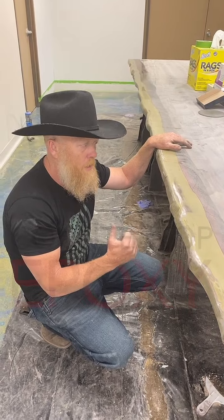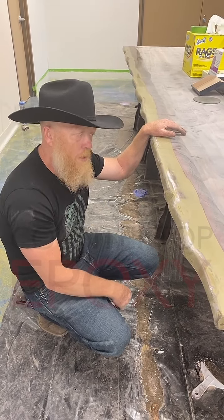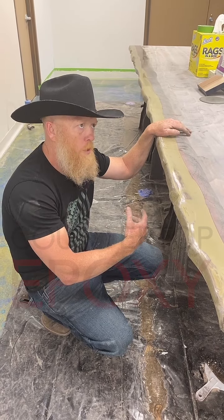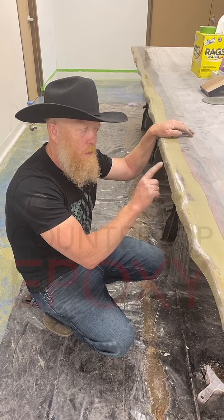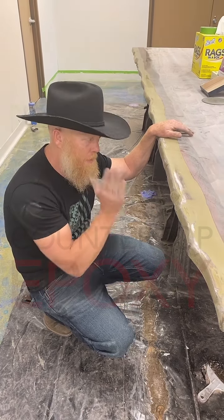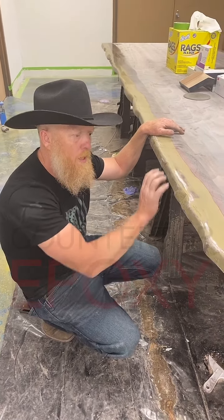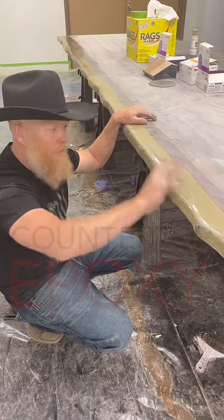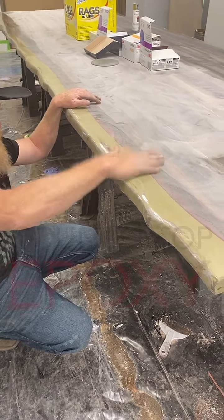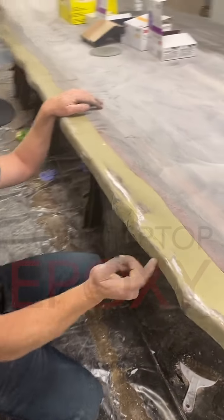But what I was thinking of is to deal with the low areas, spraying mirror backing spray. So you still get the overall tone of the bronze in there, so you see a tiny bit of that, but anywhere there's a total void where your pad doesn't get down and actually reach, you'd see the mirror backing spray, and then top that with a urethane. And I just do that right up and let it go over the edge, because then I would just polish this hard top, and the top would be a hard polished top transitioning in on a real straight line to whatever that edge is.